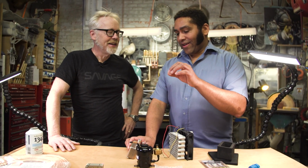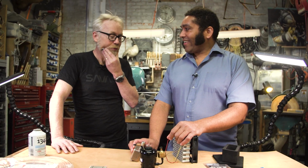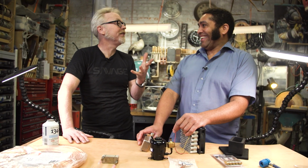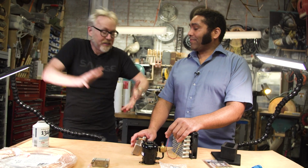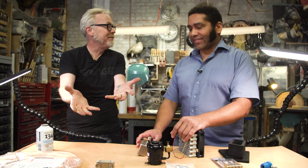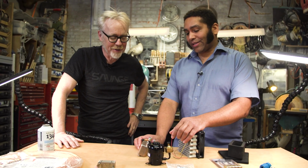That's amazing. In my book, when I was writing the chapter on glue, that was one of the hardest parts to write. You've got to think about what the glue's going to go through. Yes. And it's expanding and cooling. That means it's going to work itself away from this or that material if it's not the same material property. Exactly. Very cool.